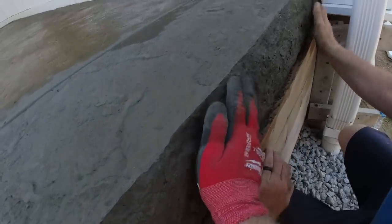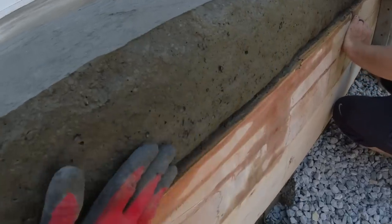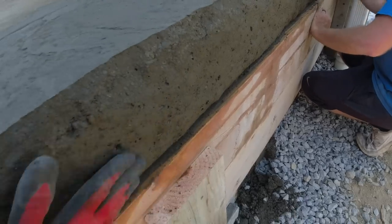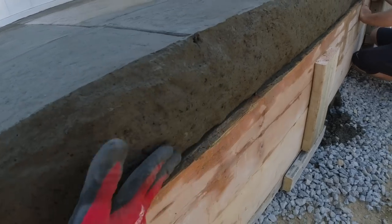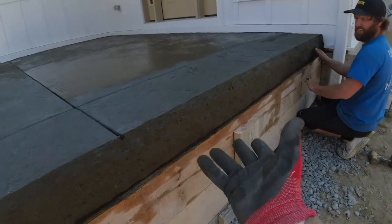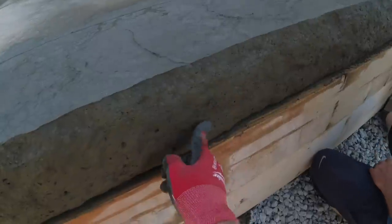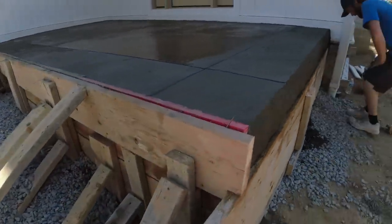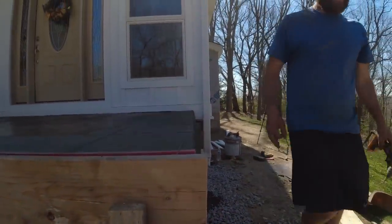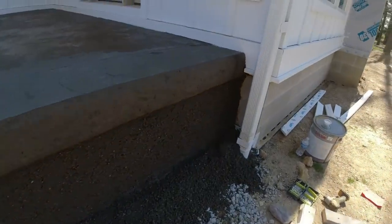Still really soft. A little bit more vibration and these holes will be gone. As we got up to the top I really backed off on the vibrator — I didn't want the form to push any more than it was. Let's take a look at that. Pull the front, please. Yeah, it really pushed — as straight as an arrow. Those things — I wish I would have thought about it before we formed it and poured it.